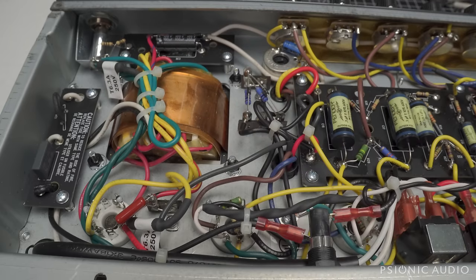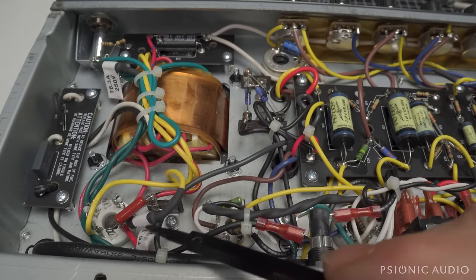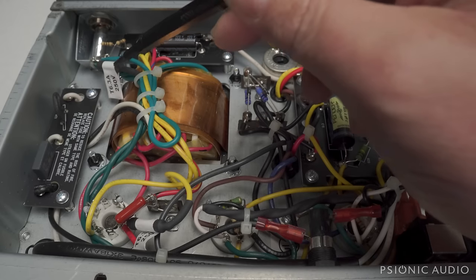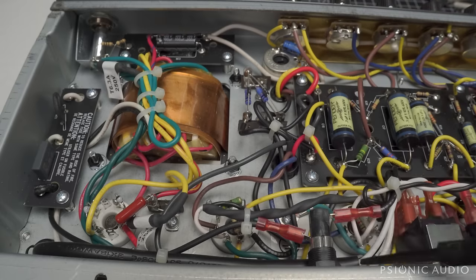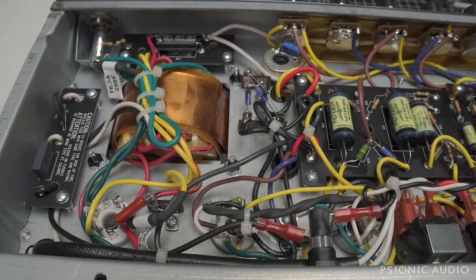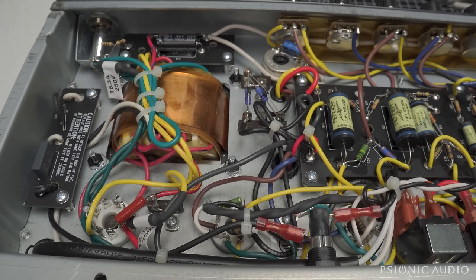Whatever. Here, there is an HT fuse, an inline fuse off the rectifier tube. There's also an inline fuse here, 6.3 amp, on the heaters. These are there in case you have an HT short or a heater short. Well, the old ones didn't have it. Arguably, the HT is needed, but if they're doing a new version of this amp, they could have just added a rear panel fuse for the HT. There's plenty of room right here where the ground switch traditionally would have been.